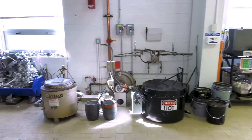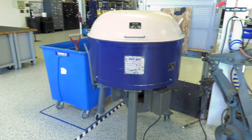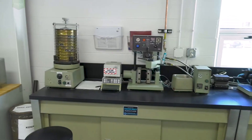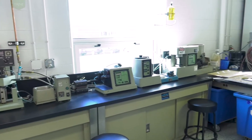There's also a student-designed and built resistance furnace with similar capability. An automatic sand system and manual muller are available to produce and recycle green sand for molding. Sand molding is also supported by Simpson test equipment. The laboratory is also equipped to make investment molds and small chemically bonded sand molds and cores.